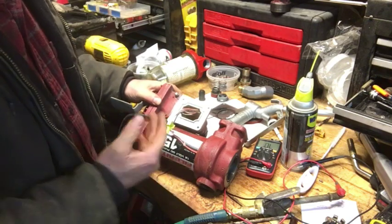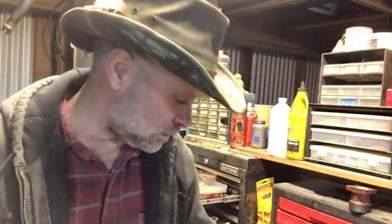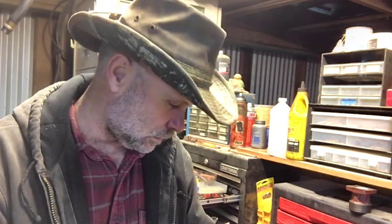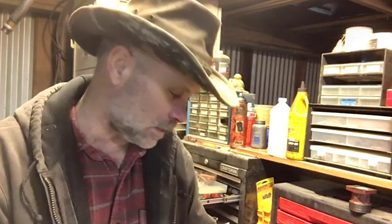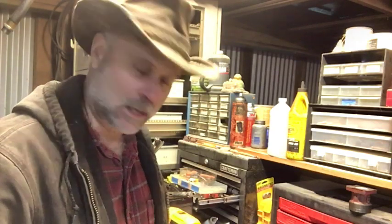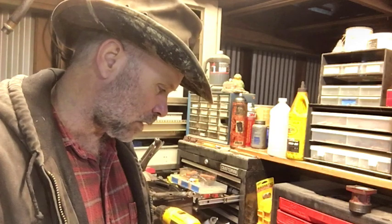I'm gonna let it run for a second or two to simulate pumping. One thing to check for when testing the motor is to see if the motor casing is getting hot - a lot of times you'll smell an unusual smell. I don't see any of that happening here. The switch works good. That concludes the test of the pump to verify I'm not wasting my time cleaning it up. The next big test will be to see if it pumps fluid. I think it will, though it may leak - if so, there are seal kits from Fill-Rite, one around fifty dollars and one around seventy.